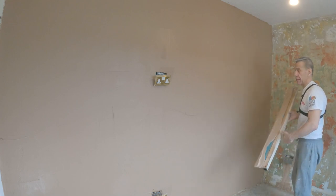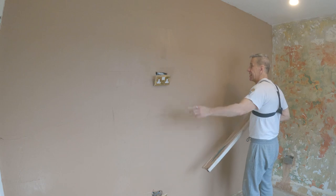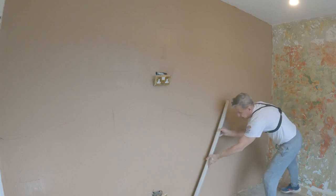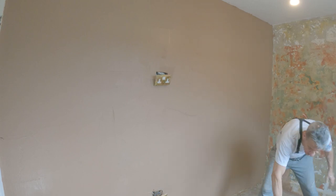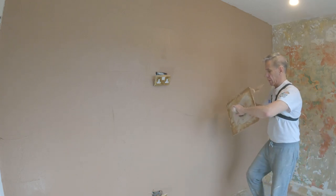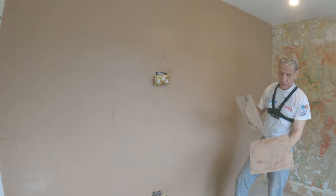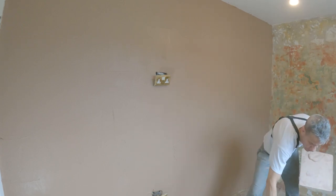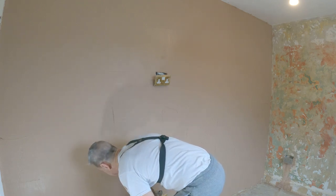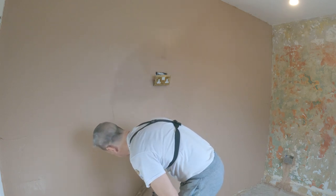I mean, the ideal when you're skimming a room is that the faceplates are taken right off, preferably by the customer or a sparky, and all the wires taped up and pushed in. Saves you having to mess about going around. A bit of a hollow there. Take that out. Skim because the radiator pipes are in the way.